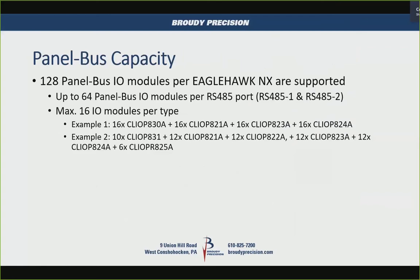Question: if I use the FT10 adapter, can I put that on an existing LonWorks network and program and use the controller, and bring it into another JACE over LON? I would think as long as you have your node number unique on the network — I haven't looked at the LON side and don't have a LON adapter to test with.